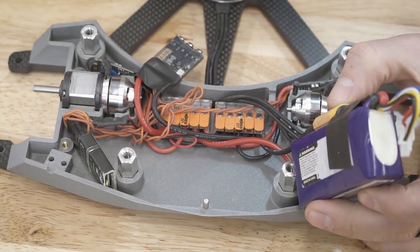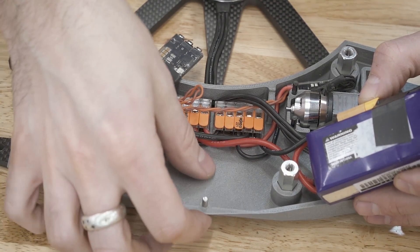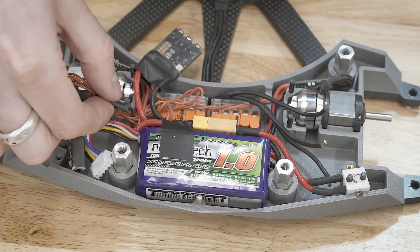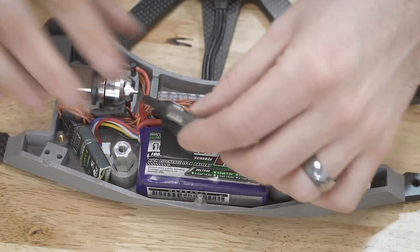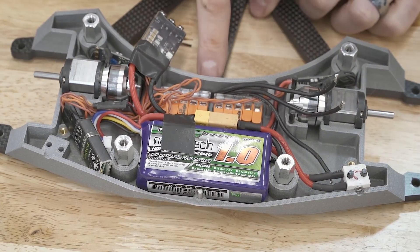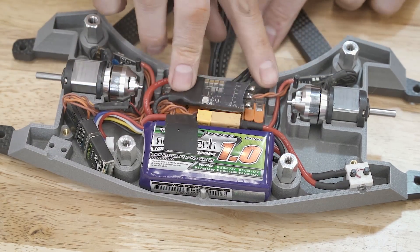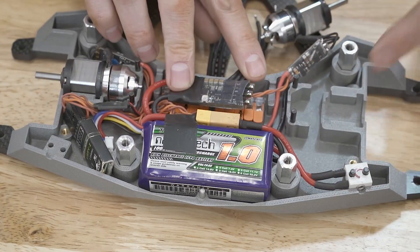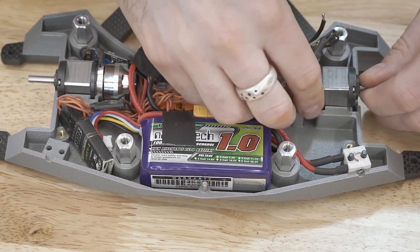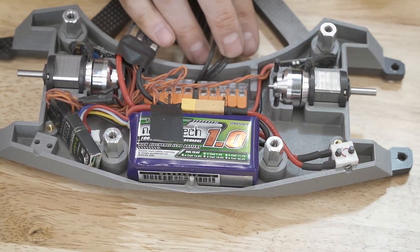The power switch just sits on posts — no fasteners. The battery takes up the vast majority of the back. There's a locating pin at the back that helps the top and bottom align and absorbs impacts across both pieces. We have the radio over here, and a little BEC — battery eliminator circuit — right there, which has always been helpful. Both the top and bottom have a cutout so wires can fish through for the motor. The drive motors are fully protected by little walls so when the top and bottom are on, nothing can interfere with the outrunners. The ESCs are also fully encapsulated.